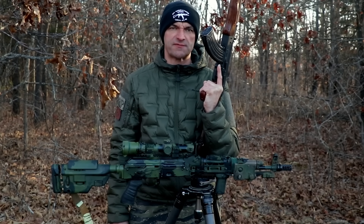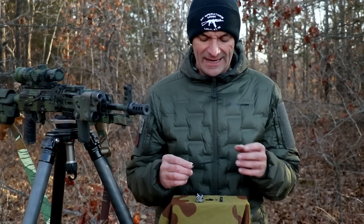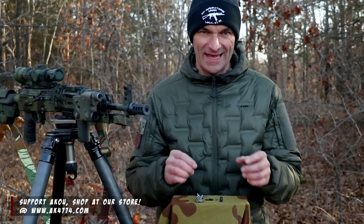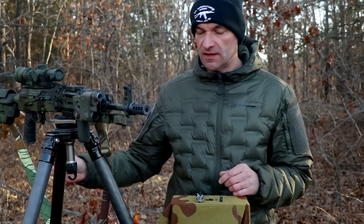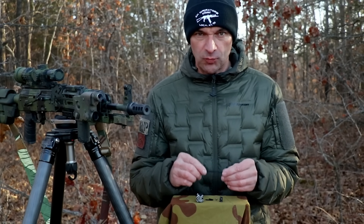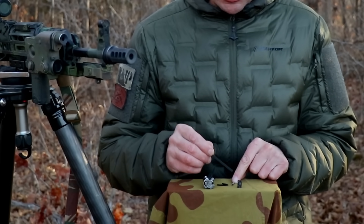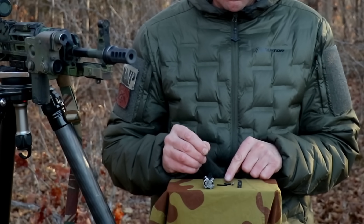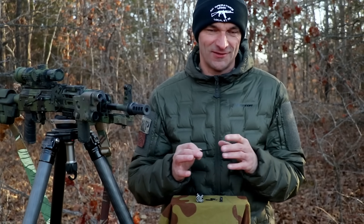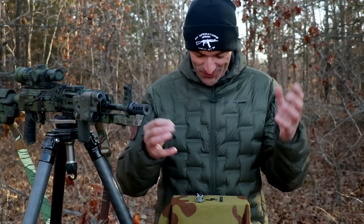The AK rifle will run almost forever, but when it goes down, most likely you will need these parts to fix it. I call that the AK bolt repair kit. You can get those kits from our store and they literally fit in the pistol grip pocket — you can store it there and have it with you forever. Inside you have the firing pin, extractor claw, extractor claw spring, firing pin retainer pin, and the retainer pin for the extractor claw. This is based on hundreds of thousands of rounds fired and what I have seen in the field from you as well.